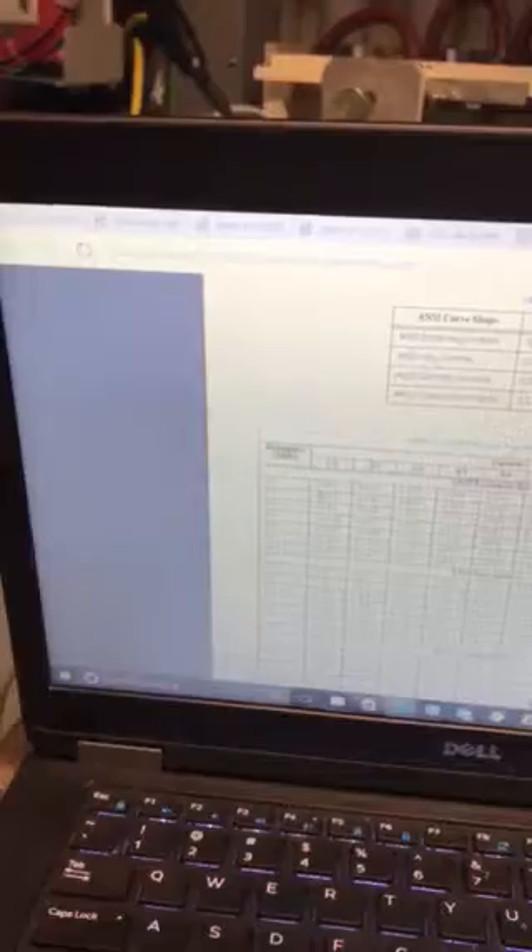You don't need a comprehensive understanding, but this time delay multiplier relates to the curves on the trip time. And 1.5 is literally the multiplier times the CT rating. This four right here represents the four seconds it should take the relay to operate.